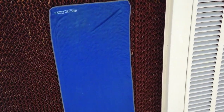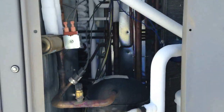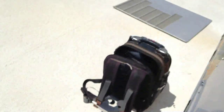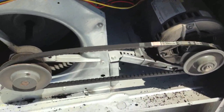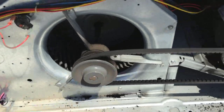This is how I like to get my neck wrap nice and cold — put it on the front side of the pads. Here's the air conditioning system I'm looking at now. I'm convinced we have a fan problem. The belt's hurting — I can almost stop it with my hand. I need a new belt. I'm gonna shut this down real quick and see what size belt we need. Hopefully I've got one on the truck. It's an AX39.